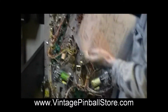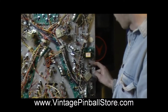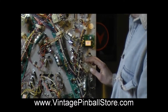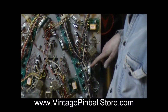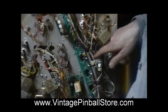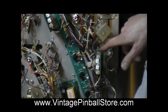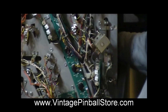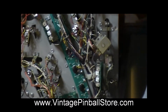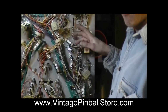If you go onto your playfield, the flash lamps multiplex with the right eject kicker, which is right here, and they use this resistor board right here. So as per the service bulletin, you move the black-white wire that used to be attached to the white wire to the other side of the board, and now those two flashers up top will be separate. One's flasher 9 and one is flasher 10. The two flashers that were removed in coil test will be flasher 7.